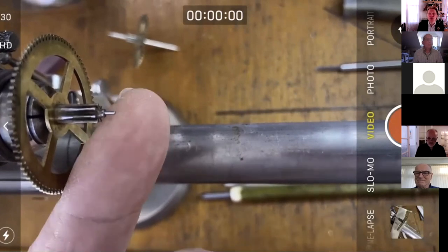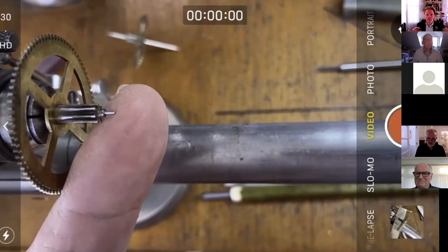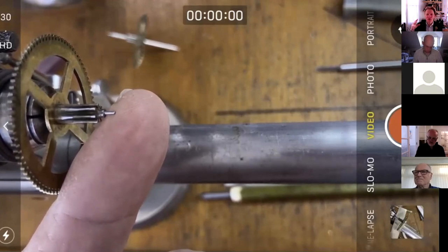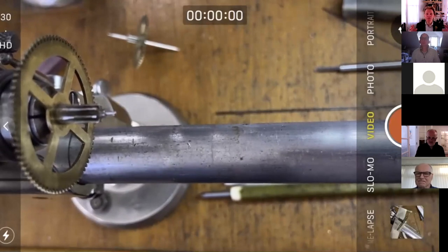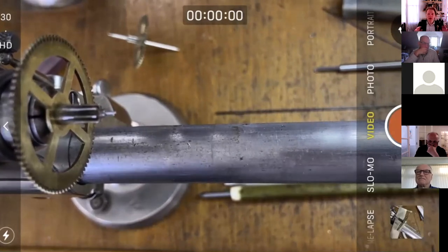But if you follow our live stream on Thursday, our rusty clock, the pivots are what people would call really grooved. And I think a lot of people would file, stroke, polish, burnish those grooves out. And for me, what that does links back to our bushing question. Bushing is inextricably related to depthing. If you reduce the size of the pivots, you change the depthing, and depthing normally causes a problem when mobiles move apart and operate outside the pitch circle diameters, and you get engaging friction. So you get more action before the line of centers. If you reduce the size of pivots, typically you're going to make that situation worse. So I imagine any benefit that you get from an improved bearing surface is probably taken away with the depthing thing. But anyway, enough of that rant for the time being.